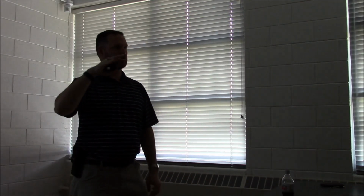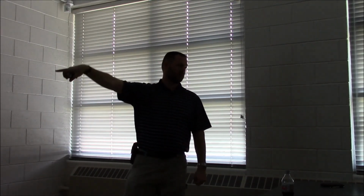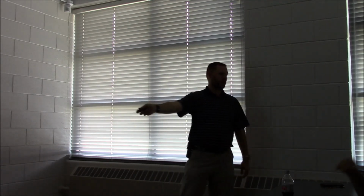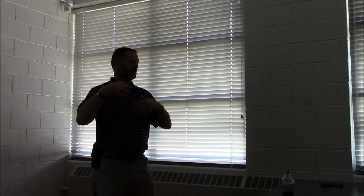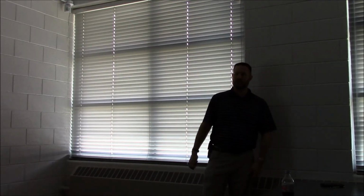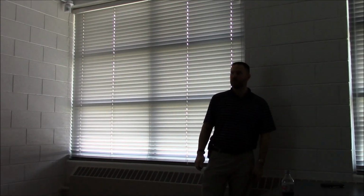But your survey party, even if you've got contract surveying and you need them to come check something, one of them is going to set a benchmark. If the one you're talking about is gone, they might not even use the one location sent, but they just put it in there in case you want to use it. They may set their own benchmark in a location that's closer to the job or easier to access during construction. But they put this information in the plans just so you have it if the surveyors want to use it.